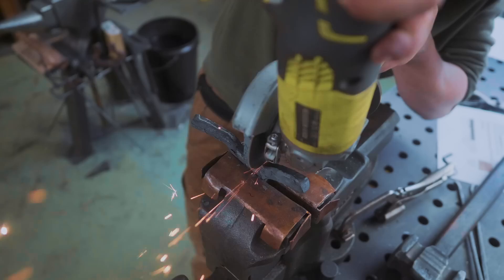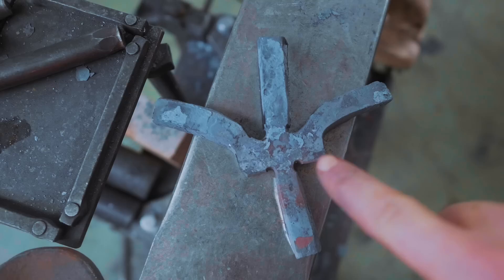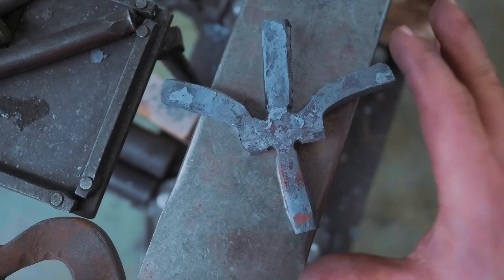I'm pretty happy with how progress is looking. I like that we've got plenty of meat in these little corners — I think that's going to be helpful to forge out the shapes, avoid cracks, and also avoid any thin and weak spots. Next step is going to be squaring up the tines, forging them out, making sure they're straight and neat.